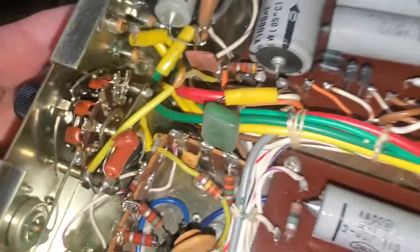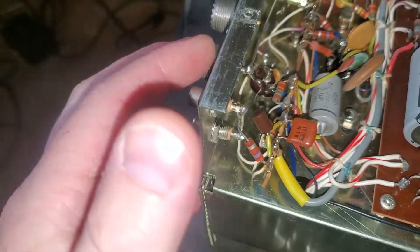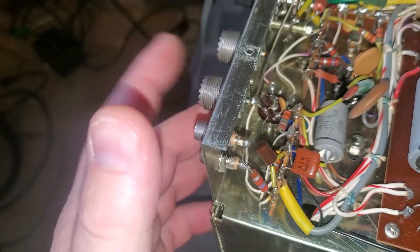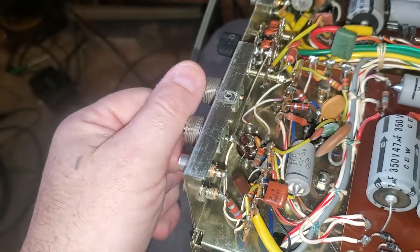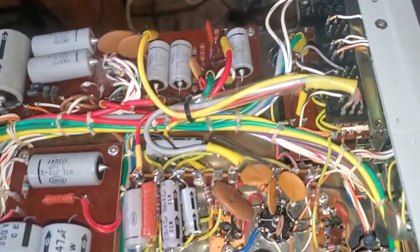What happens is you have this hooked up and you got electricity flowing through here and it gets into your radio. And when you go to change your coax and you lean on one radio and touch this, you'll get shocked because you're connecting the ground using your body. That's how I figured out it was leaking.